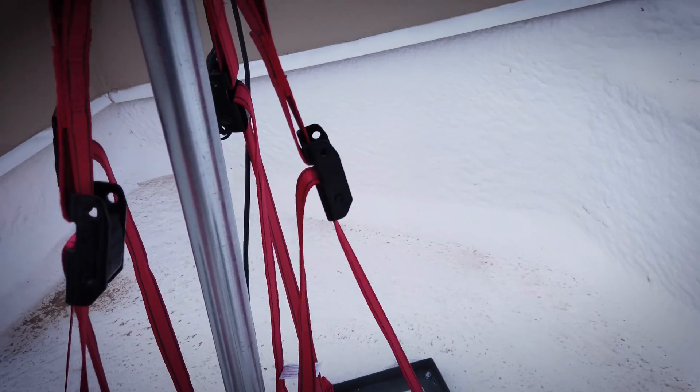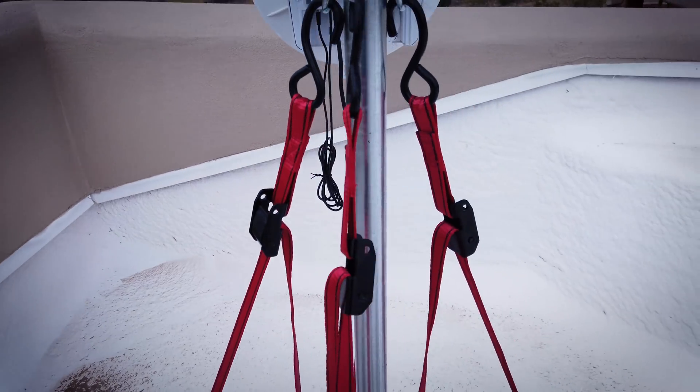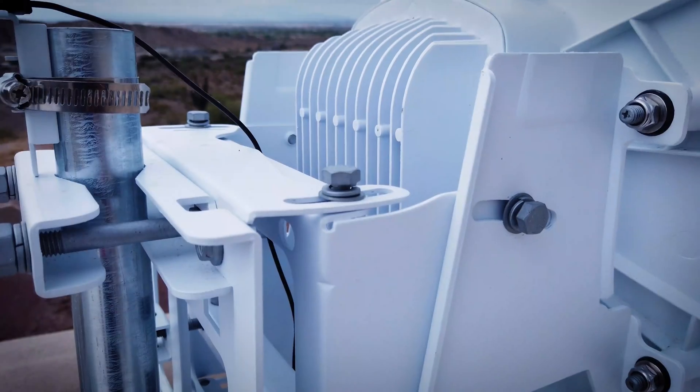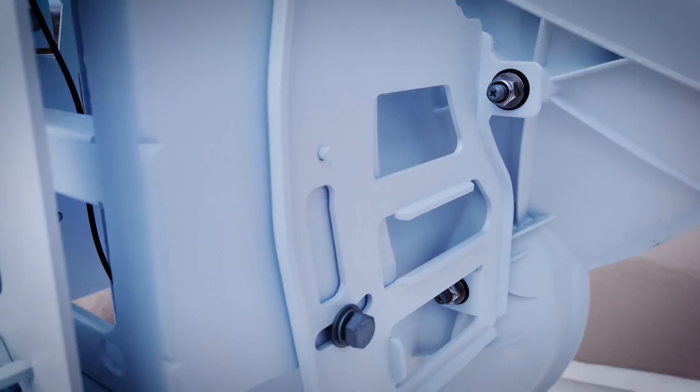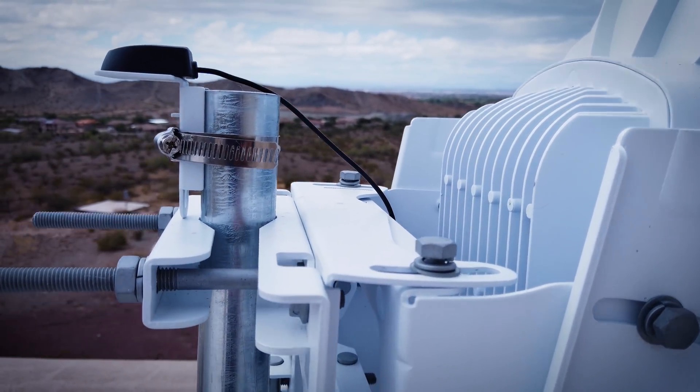It's as tight as I can get them, but they're not tight at all. So what I'm going to do is leave these for now and come back up and fix this with actual real ratchet straps, because these things are not getting anywhere near tight enough — not even close. I can see the thing moving around still. But I also noticed in the midst of all this that I forgot to tighten all the aiming bolts. The wind's blowing it around, but it's just flat out out of aim — completely. The thing moved. I'm going to give it a re-aim, leave these here for now, and come back up and re-ratchet-strap it for real.